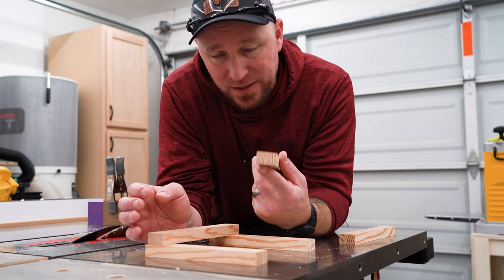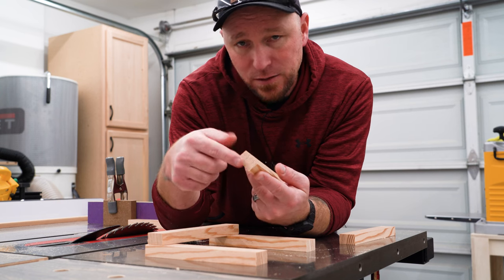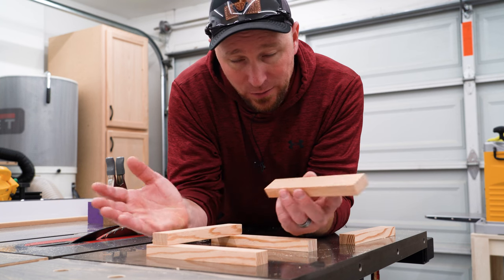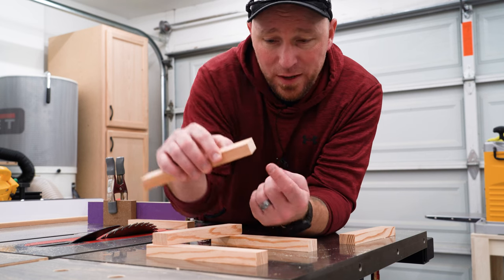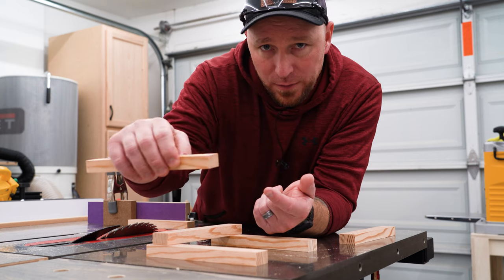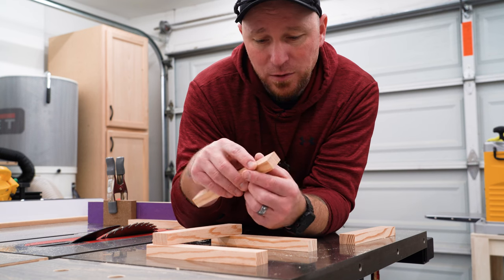It means I need to know half the thickness of this. I could measure it and then divide that by two, draw a line here, and then set my saw blade to that and see if that works. Another popular method without any measuring is to take it to the table saw and run a blade's width cut this way with the blade up about just under half or so, and then flip it over, run it through this way, and try and get that little nub that's left in the middle as close to zero as absolutely possible.